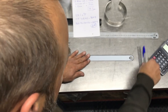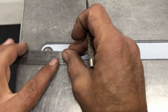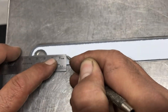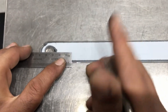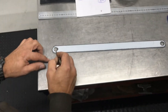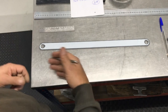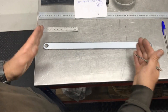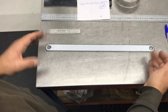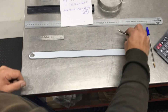So our total is 468mm. I'm going to measure this — we've got our 50mm tabs at each end, so I'm going to put a scribe mark at 50mm, turn it round, and another scribe mark at 50mm. These holes have been pre-cut because this is a laser-cut bracket — I don't want to spend all day drilling and cutting. Normally we could have them folded as well but I sometimes prefer to fold them myself. Now we'll fold these two tabs over at the folder.